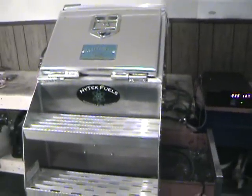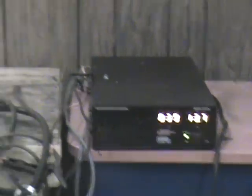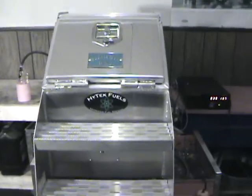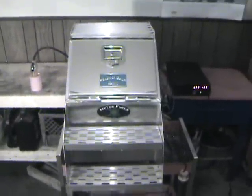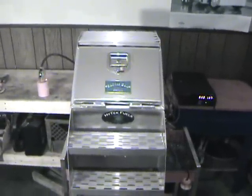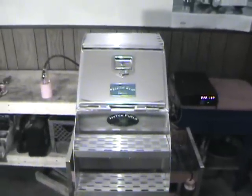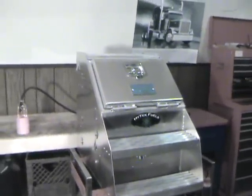Right now the system's running — you can probably hear it. We're pulling around 39 amps on just a 12-volt power supply, hooked up here in the shop. Over here on the side you can see the gas output, which I'll give you a demonstration of in a minute. It's a system we can basically mount in any kind of box — we've done some underbody boxes and boxes for tractors that fit on the back of the tractor.